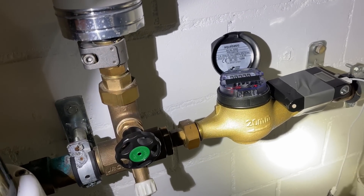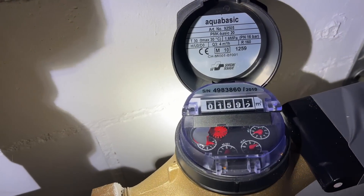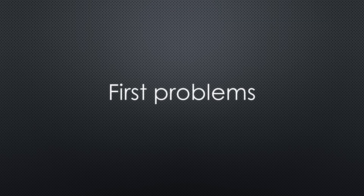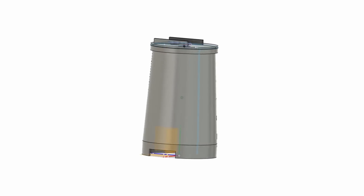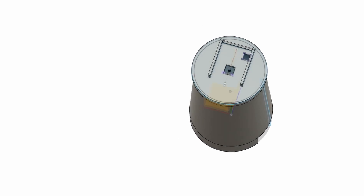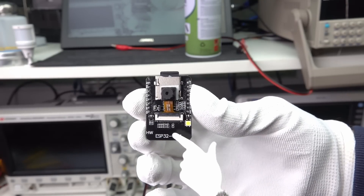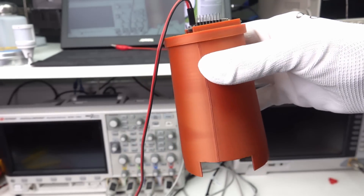The next step is to create a part to mount the camera at a certain distance from the counter — 10 centimeters is okay. Now comes the first problem: the project creator seems to live in Germany and their counters are slightly different, so I had to draw my own 3D design using Fusion 360. Not a big deal. The camera hole has to be in the center and the opening for the LED obviously where the LED is. After a few hours of printing, the part was ready and I could continue.